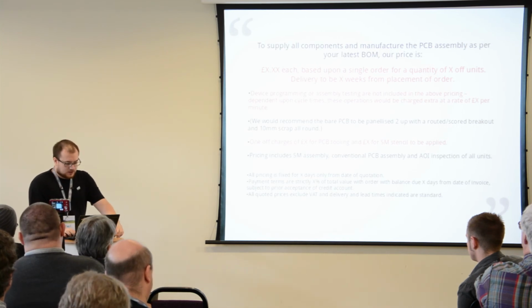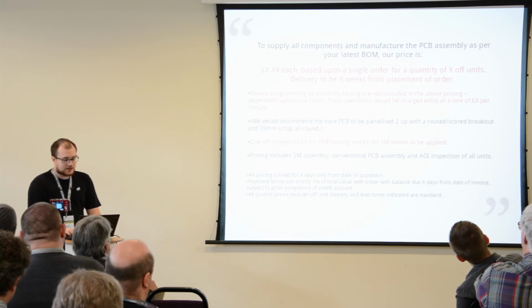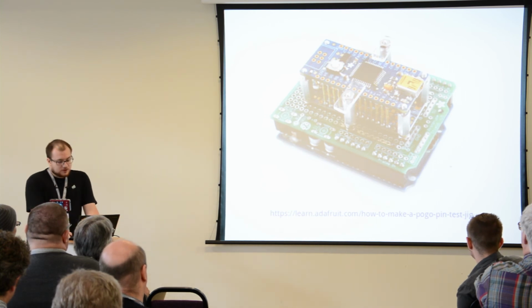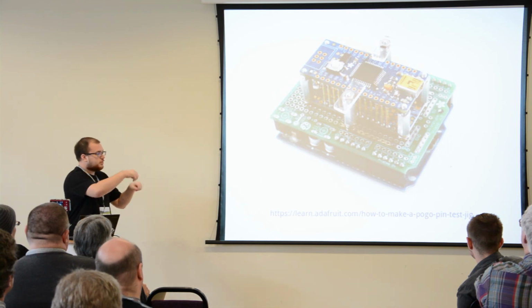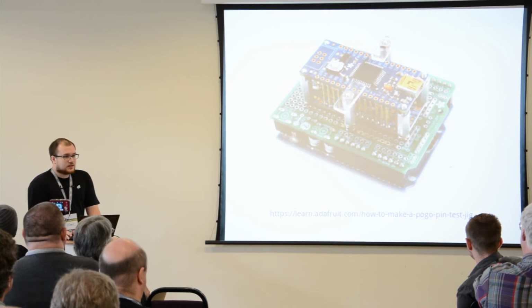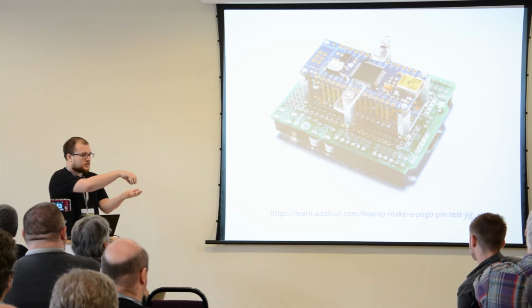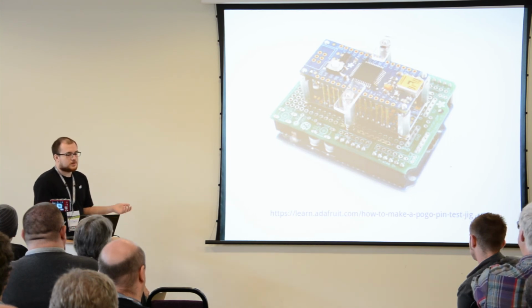And also, you will have to pay one-off charges for tooling and all sorts of other NRE expenses. So one step in reducing the manufacturing time is actually automating your testing. So you have a circuit board. If it requires someone manually plugging things in, putting some probes on it to look at an oscilloscope output, whatever, then you've lost it. You have to automate that and essentially turn that into, plop it onto a test jig. If it beeps, it's okay. If it doesn't beep, just throw it in the bin to be looked at afterwards.